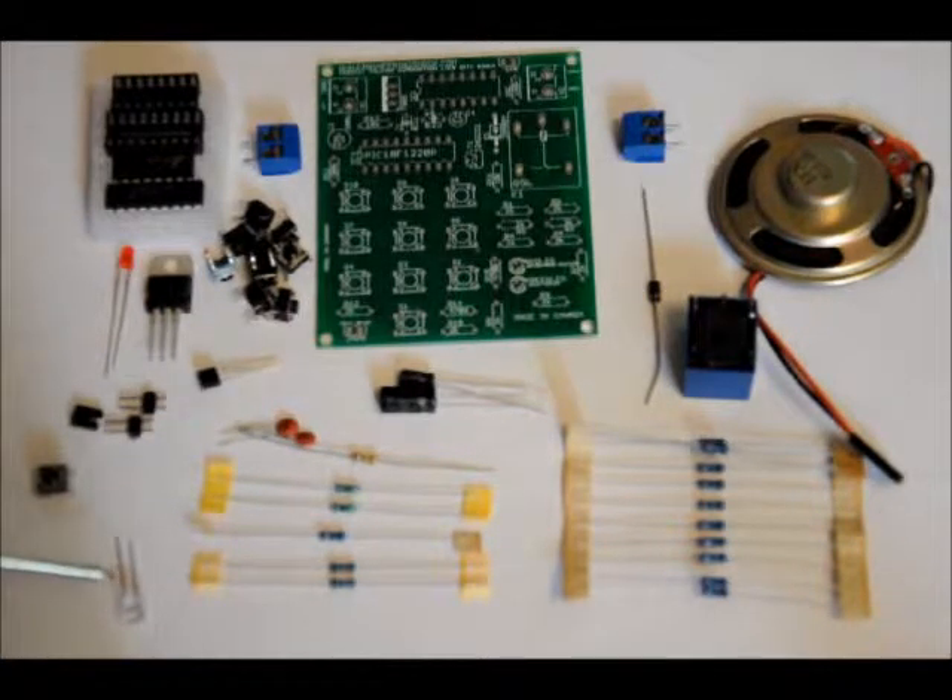As well, a green LED, a red LED, a push button switch, two 2-pin headers and a single header connector, a 2N2222 NPN transistor, a 5-volt regulator 7805, 10 momentary push buttons total, an OTP recording IC, a programmed microcontroller, an 18-pin socket, and a 16-pin socket — DIP of course.